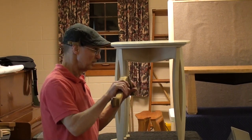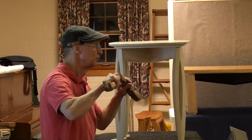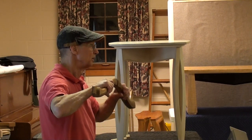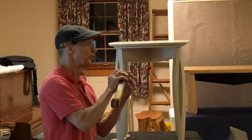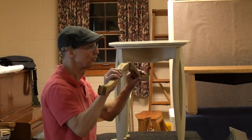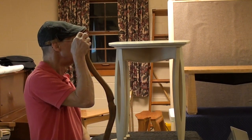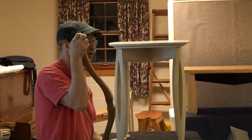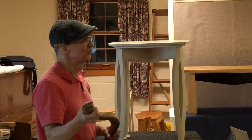You don't worry over time about the difference in grain movement? No — you're using the same materials, in fact a lot of times from the same board. There's not much width on these pieces, and most of your movement is through the width, so it's not going to move much if you're talking a few inches. That's actually a really excellent point, because so many people either ignore seasonal movement, don't take care of it, or don't understand it — and that's a shame because then pieces start to break apart.